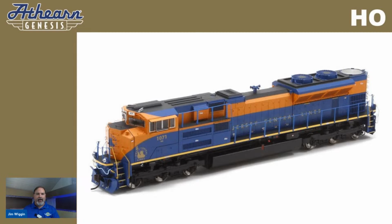Much of the external design is based on the SD90 series of locomotives. Similar features include the full-height nose door, rectangular windshields, the large flared radiators with 2 fans, and the positioning of the dynamic brake equipment at the rear of the long hood. In addition, the inverters were removed from inside the long hood to a box on the walkway behind the fireman's side of the cab.